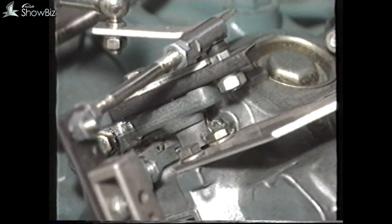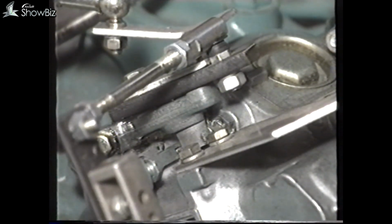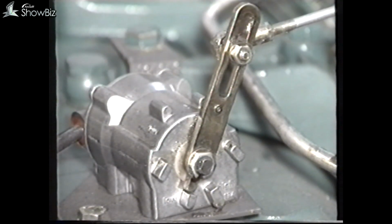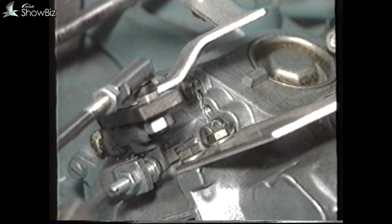With the engine stationary, operate the throttle pedal fully and make sure that the fuel injection pump lever is in firm contact with the maximum speed stop. Remember, if any adjustments are made to the throttle linkage, be sure that the ZF gearbox load sender is readjusted correctly. Always ensure that all tamper-proof seals are intact.